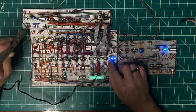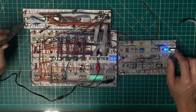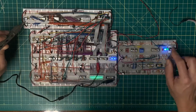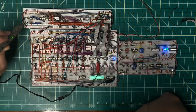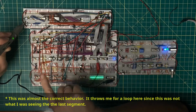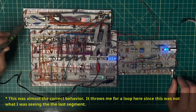And that reset. So the next one is going to be the output. Now I'm expecting another 16 bits of zeros. This is high impedance, which may be something to deal with here. And it just went high. That was not 18 clock cycles, I think it was 16 when that started outputting data. And if I keep ticking away here, I should see some high values come across, which I did.